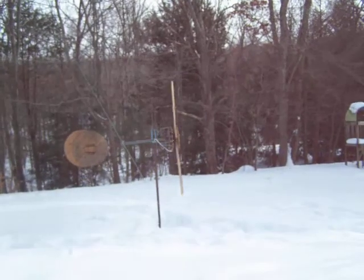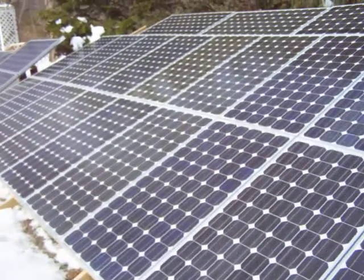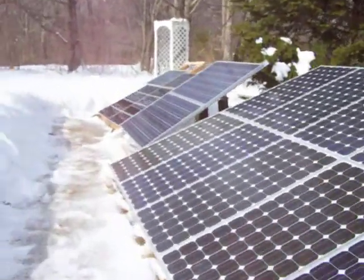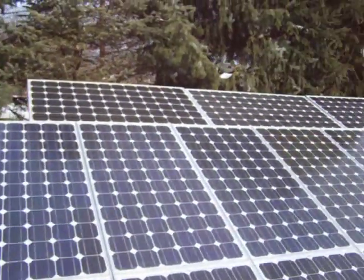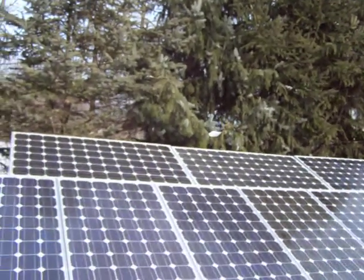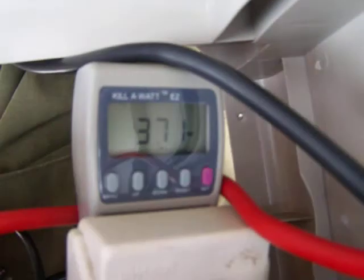These two turbines are right on the ground. Here's the solar array — there's 21 panels on this big array. The bottom nine are on Enphase, plus these two big ones on the end, which I think are 224-watt — I just call them 225 to make it even. They're all on Enphase. The top row — top nine plus the third row of three — are all on the five 500-watt Sun G's. You can see right now they're putting out 370 watts. They're all working. You have to take my word for it — they're all moving.